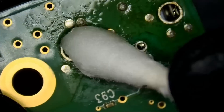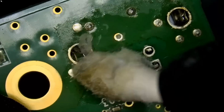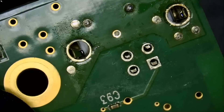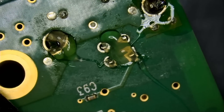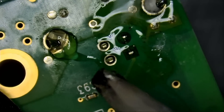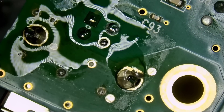We got the pins in very nicely. Just a quick cleanup before we apply solder — I like things to be perfect. We need a lot of solder on this joint. Let me do the small ones first so we can hold that connector down flush with the board. Let me rotate the board because right now I have my finger under the connector while soldering so it stays flush. Now that we've soldered three legs, we can do the rest.